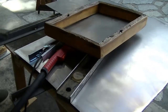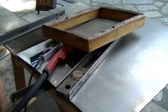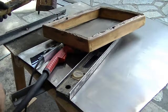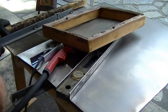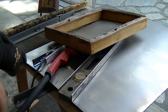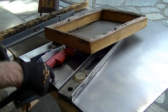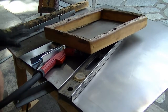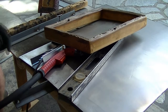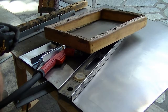So anyway, just wanted to show you my plasma cutting table. We just made these real quick. So these pieces of wood will go in the fireplace. These are done. So now I won't start the house on fire, hopefully, either with my standoffs. And I like only a couple of standoffs because the more you have back behind what you're cutting through, you get blowback whenever you go over one of these ribs. So I try not to go over any ribs whatsoever on anything metal, or definitely not the old wood that I was using. Because then the picture of the cutting doesn't turn out as sharp and neat as I'd like to. So anyway, that's all for now.